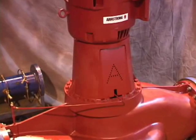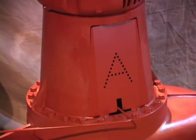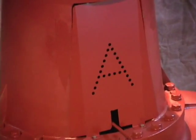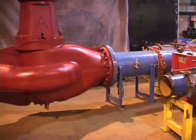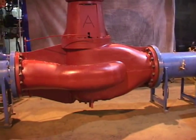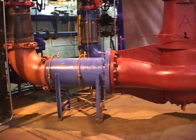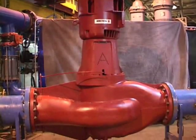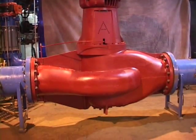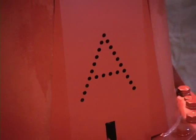All Series 4300 VIL units are pipe-mounted as illustrated in this video. We have the demonstration unit installed in a factory test loop with loosely supported piping, and one can readily observe that there are no supports directly under the pump. This type of unit becomes an integral part of piping, and typical installations need no pump supports or flexible connections to the piping. This is of great value to the system installer.